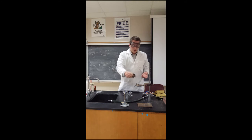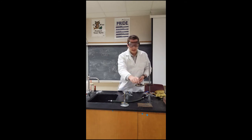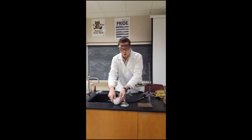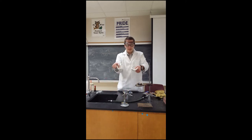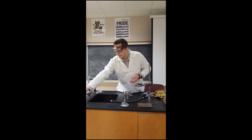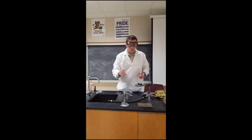So what we do is put that in there — it lasts a while, students can knock it around, it falls down, doesn't break. Conversely, you take something like this ceramic piece, you drop it, it's going to bust. Or if you take it while it's really hot and put it on a cool table, it's going to break in half. That's called thermal shock — that's thermal expansion or contraction happening really quickly, and it just causes that crack to happen. We don't want that.